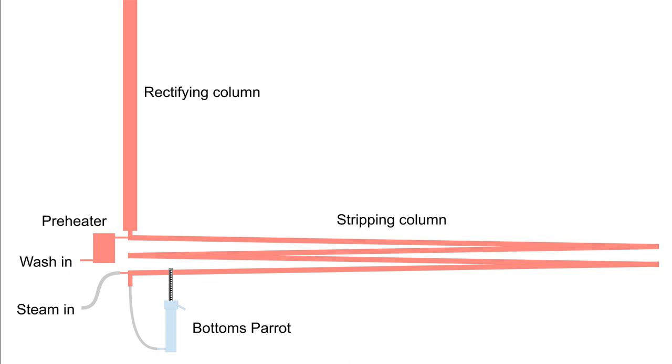That's a wider range of operating conditions than other types of column tolerate. The importance of this is that you don't have to carefully match the stripping and rectification columns. Packed columns operate optimally over a narrow range of vapour flow rates, and to get stripping and rectifying columns to operate optimally together, they have to be carefully matched. There is no satisfactory, widely available software system for modelling this mathematically, and so it requires a lot of experimentation. Not only that, but once they are matched, they will only tolerate a fairly narrow range of wash concentrations. It becomes easier with a stripping column made of sieve trays, and easier again with bubble caps, because of their tolerance of a wider range of operating conditions. But such columns get long and expensive, and as far as I can tell they don't match the performance of this sloping tube.